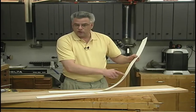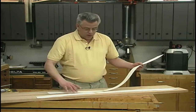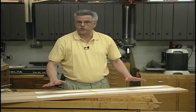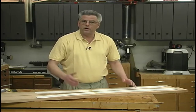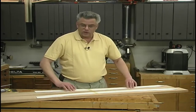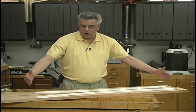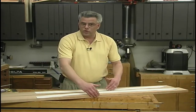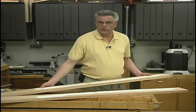There's an area marked on the template — a flat area — and that's the area where the front and back legs will join together. Trying to get this very unusual shape out of a straight piece of wood can be a very complex, complicated procedure. But what we've done on the drawing is take you through the progression — there are about four steps to get from our solid piece of wood down to a piece of wood that looks like this. Our first step is to get our stock cut to its approximate overall length, leaving it a little bit long to start with, then rip it to the width shown for our blank material.